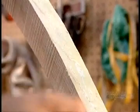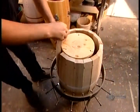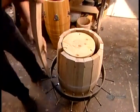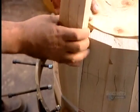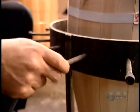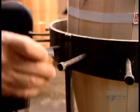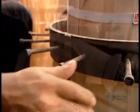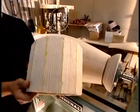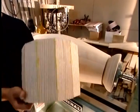The drum maker applies carpenter's glue to both edges and clamps the slats together in a circle on a specially designed form. The number of slats per drum varies depending on the diameter of the shell. The larger the diameter, the lower the congas sound. The glue dries in 24 hours. It comes off the form looking like this bongo shell, but taller.